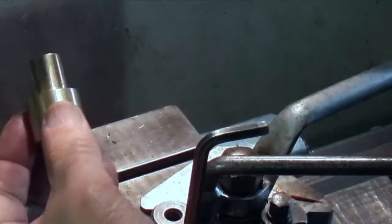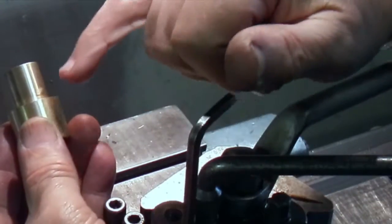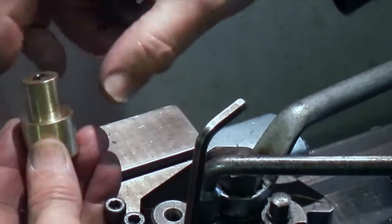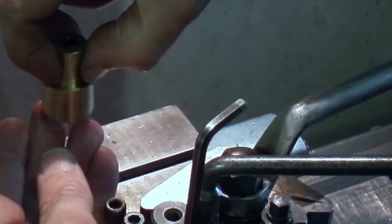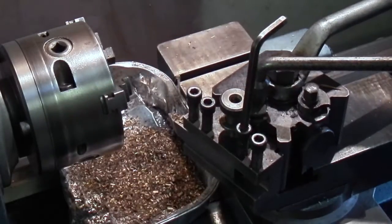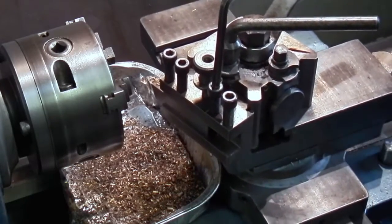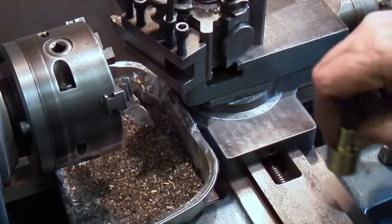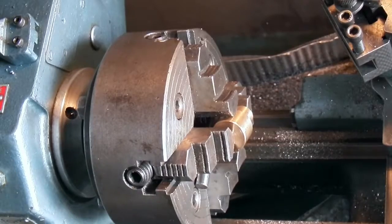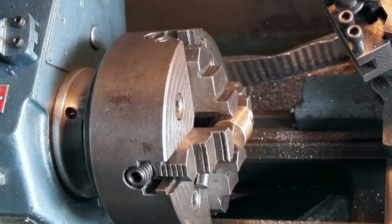So far that is the blank. I've got to put a quarter-inch hole in the side here, and a little pin goes in so as you tighten that down the pin is pushed out the side — that's what grips it into the cross slide. I've also got to put a flat on each side because at the moment this is too wide to fit into the cross slide. It's going to go in between this gap and it's just a bit too wide, so I'm machining some off each face of the nut so it will fit in this slot.